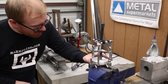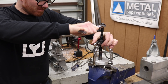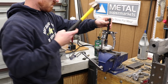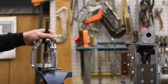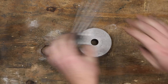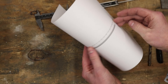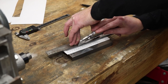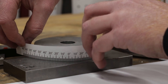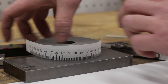I'm going to try to use this wheel puller to pull this off. The book indicates to use a six-inch flexible steel rule with one thirty-second inch divisions and then turn the diameter of the protractor disc so that those one thirty-second inch divisions make one degree — that's 1980s talk. So I used Adobe Illustrator and made my own custom graduations based on the actual measured diameter of the protractor disc.